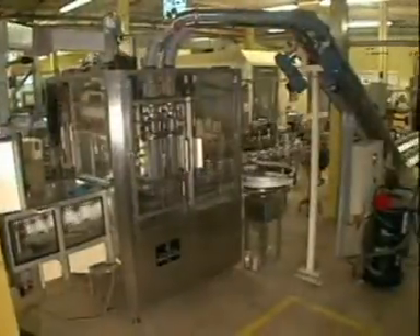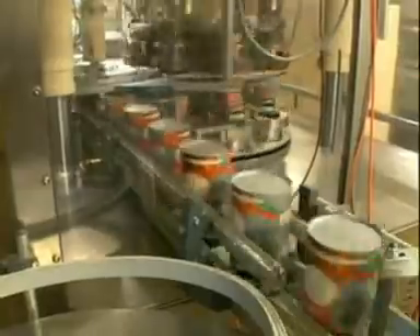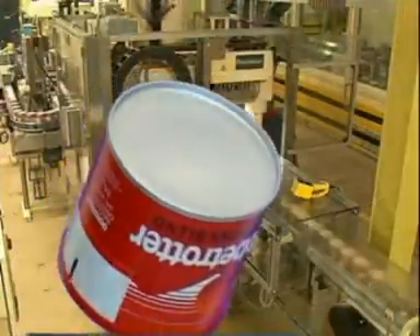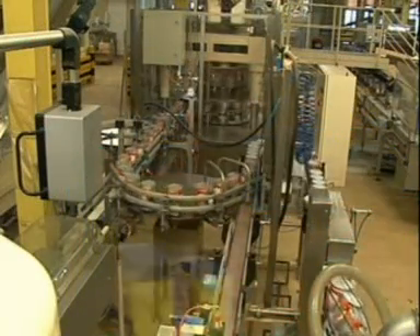Sealing machines in the raw series from Lehmann Kirscheis, run by the Leonhard brothers, are individual customised solutions which nevertheless take into account the flexibility of future aims. The machine's basic design means they can be reset to other can heights at any time. Besides cardboard, other different sealable material combinations can also be processed to seal bottoms, lids or membranes onto can bodies, irrespective of whether round or unround, ensuring fast and reliable sealing.